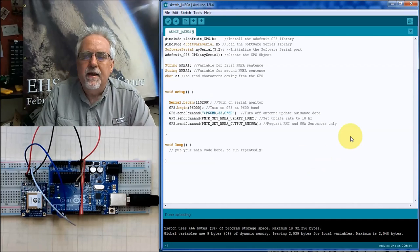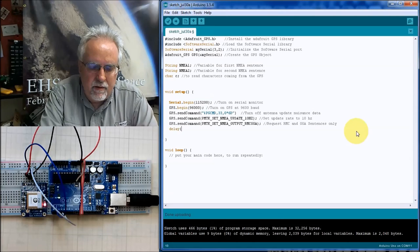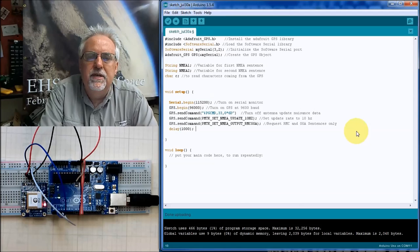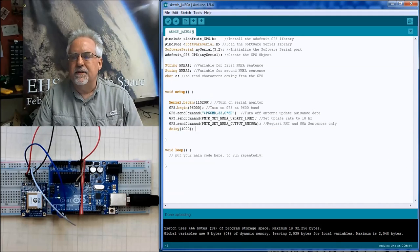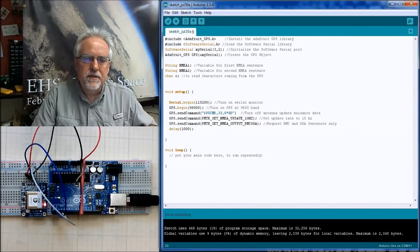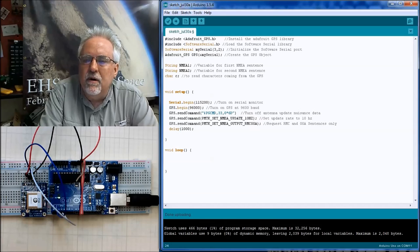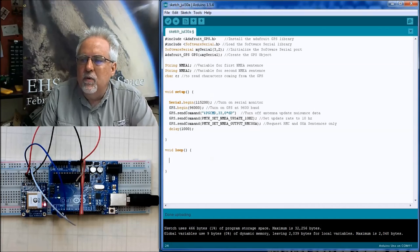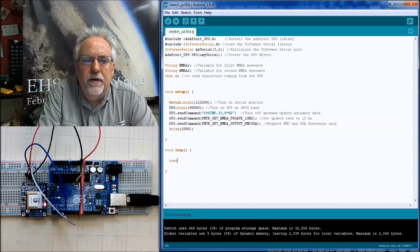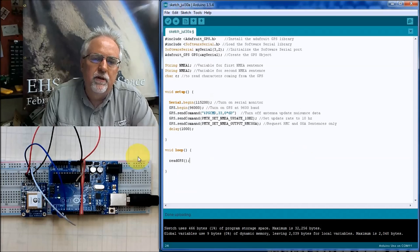All right. Now, let's give it a second to digest all this, so we will say delay by 1,000 milliseconds, just to give it a chance to get all this information in. All right, now let's come down. We are actually getting pretty close here. This gets pretty easy, and what I'm going to do is I'm just going to write my own function, and then I'm going to call it, and the function that I am going to call is readGPS. And what I'm going to do here in my void loop is I'm just going to sit and read GPS.